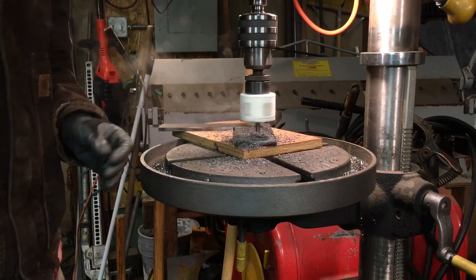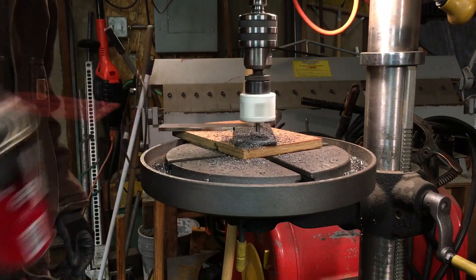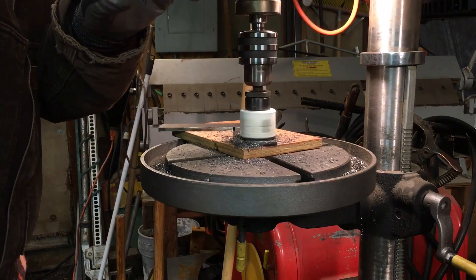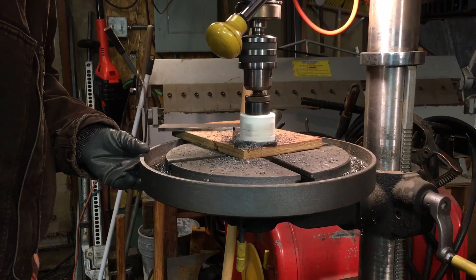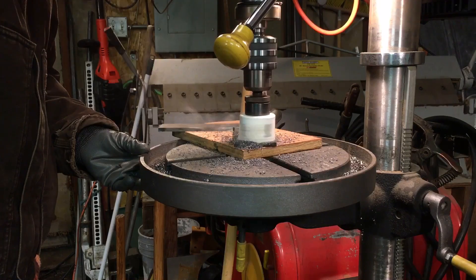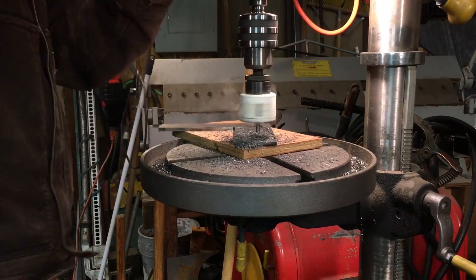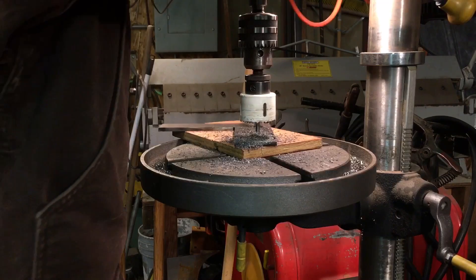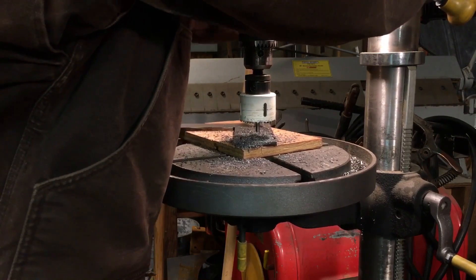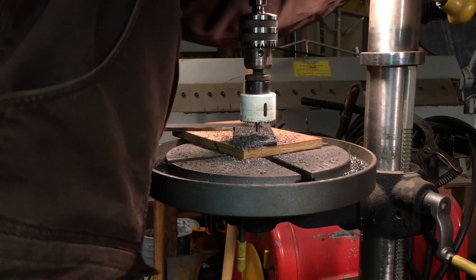Stalled a little bit there. I might need to tighten the belt on the drill press, but we'll keep going and see how it goes. It can be good also to just shut down for a little bit, walk away, do something else for a while, and let this hole saw cool down. Let's see if we can get through this plate though. Okay, I'm going to tighten the belts real quick. Well, they weren't that loose — but a little bit loose.